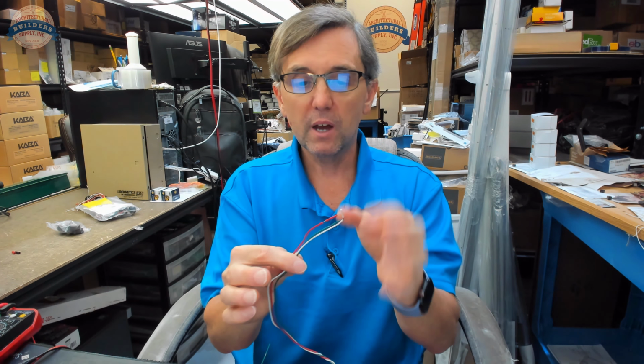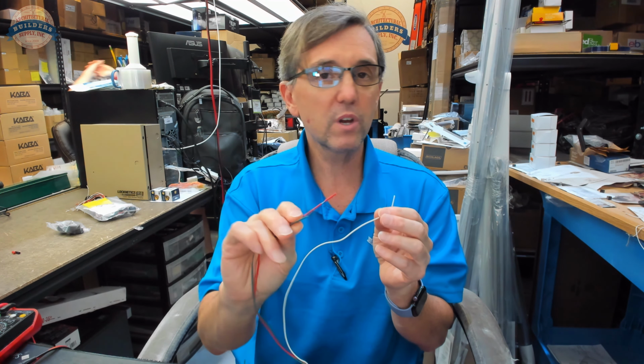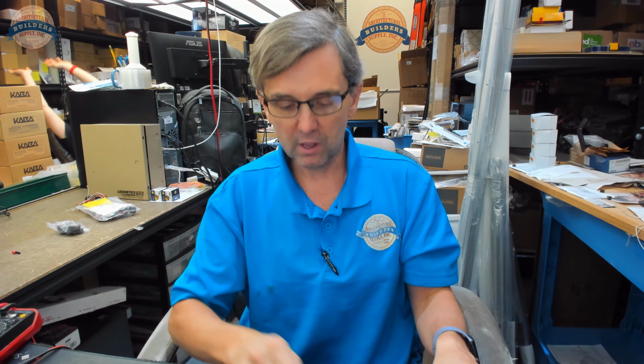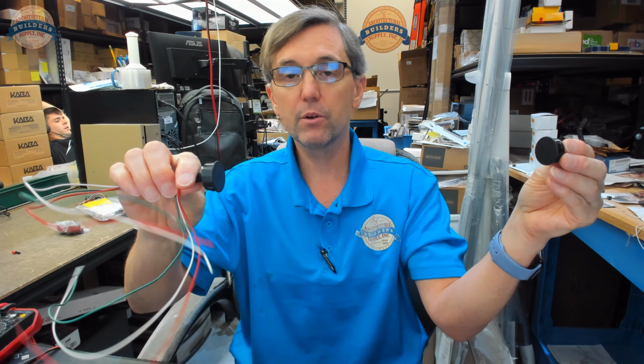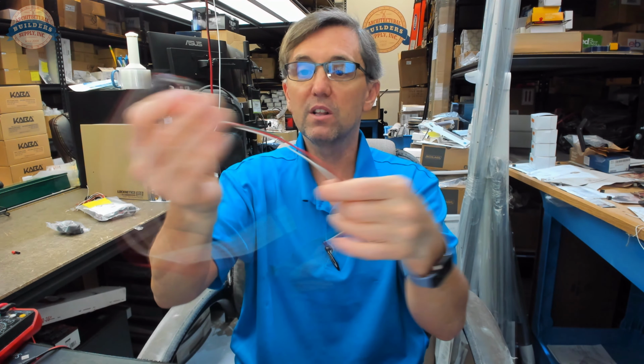Because you've got a common and you've got a normally open and normally closed leg, you can wire this either way. You want the lights off here? Great. You want them on here? Great. You want them on here and off here? Great. Whatever you want. You've got the leads to do it.